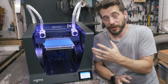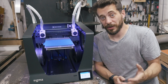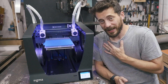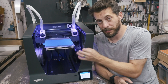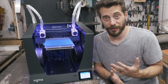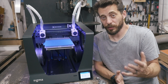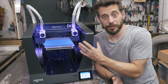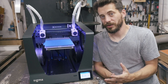One of the experiments I've really been looking to do with a dual extrusion printer is mixing materials — not just two colors, but two different materials. In the past I've done that with PVA as a support material and that works great. On this printer, I tried to do PLA and NinjaFlex. Personally, I did not have any luck getting the NinjaFlex to print correctly, but I know several other people with this exact same machine who have had great success with it. I'm attributing that problem to me because I don't have any experience with flexible materials. Mixing materials — one flexible, one rigid, or one really strong — is a really interesting use case for dual extrusion.